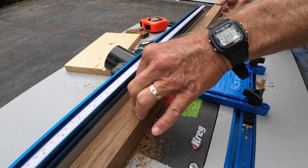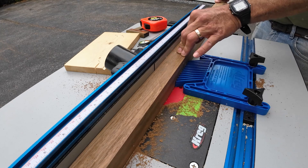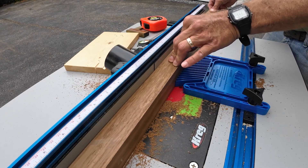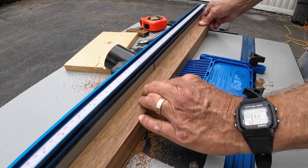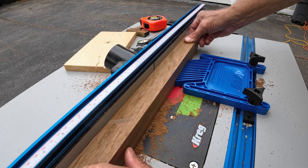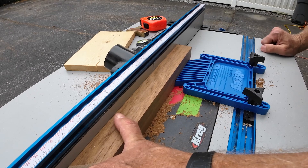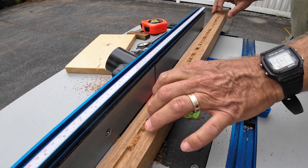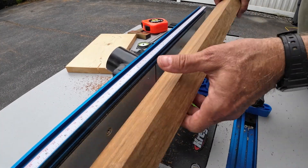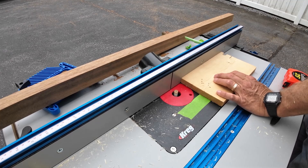Remember those marks at three and six inches? I'm only going to take the track down to about the center of that mark, because the track doesn't go beyond where the trigger mechanism is — just leave that alone and end your track in the middle. I was very lucky with the bit — I bought a set of four core box bits off Amazon from a company called Meg Tools, only 13 bucks, and they work well. Teak can be hard to deal with, but they worked.